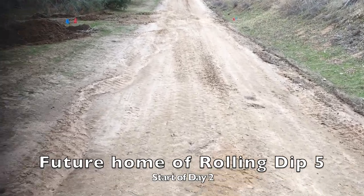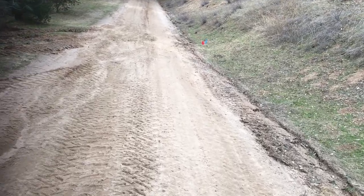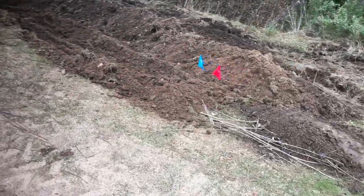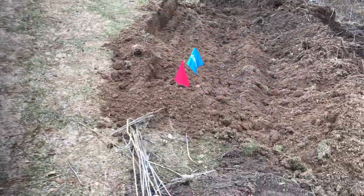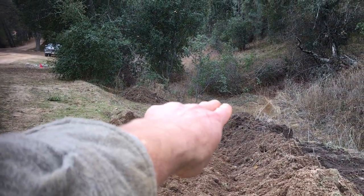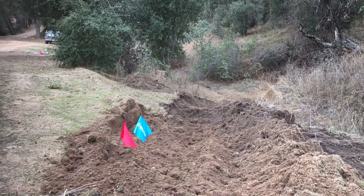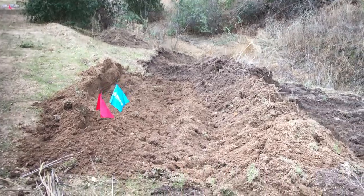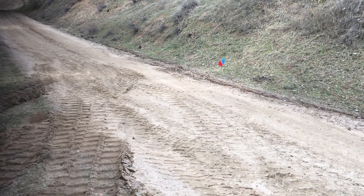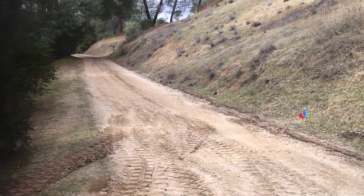Here we are at the beginning of Phase 2, Day 2. This is Rolling Dip 5, the lowest in the series where water's going to be crossing the roadway. We just had the mini excavator in to taper the rundown — you can see it here — getting a nice even grade all the way down to the low point in the drainage. We'll be lining this with gabion rock and some larger granite facing rock for a non-erosive surface, taking water from where it crosses the roadway up to where we started the bank armoring section where headcuts four and five used to be.